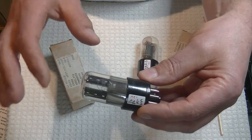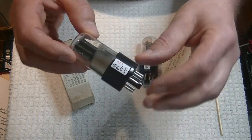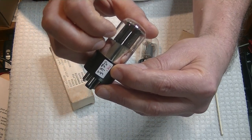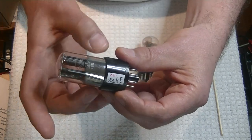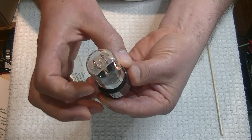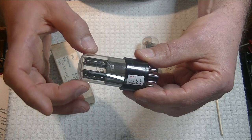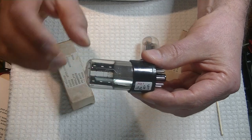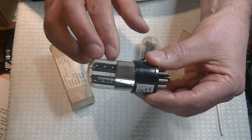On my label, I always mark in red the 12-volt tubes so we don't accidentally mix them up with the 6SN7 version. And we've got a large-waist chrome, which means we've got a bottom foil getter in this case — it's tough to see, it's way down there. And we've got an elevated black T-plate, a pair of them, of course, because this is a twin triode — two tubes inside one envelope. We've got three rivets. There are two versions of this tube that are common: the two-rivet version and the three-rivet version.